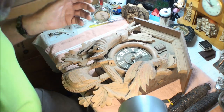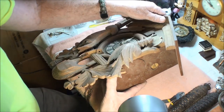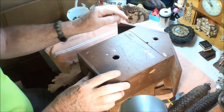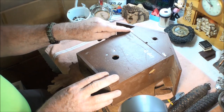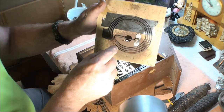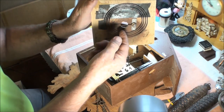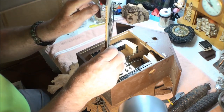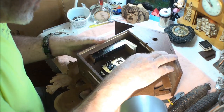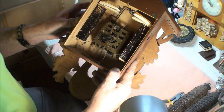Let's take this chain and try to get it set aside. This is really dusty — looks like it was out in a wood shop or something, just covered with whatever. It says West Germany; normally when it says West Germany they're not that old of a clock. This has got bug, leaves, and everything else in it. Not sure what this tape is on here for — it's getting pretty close to hitting, so I'll probably adjust this spring so it's further away from the board so it doesn't bang and make that nasty sound.